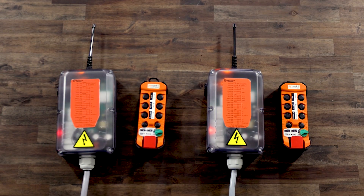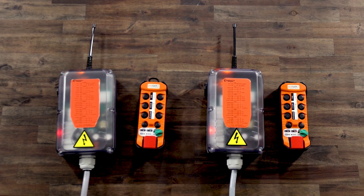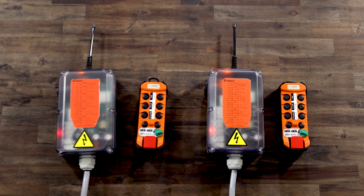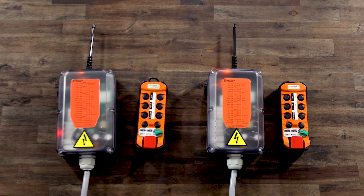We will start with transmitter A. First, ensure the E-stop switch is pulled out. Then, turn the on-off switch to the on position and verify the A through D LEDs flash. Then, press and hold F4 and F1 and turn the on-off switch to the start position and release. To disable automatic transmit power, press the AUX2 button. The B LED will flash 1 to 4 times, indicating the fixed transmit power. Press AUX1 until the B LED flashes 3 times. Then, turn the on-off switch to the start position and release. The receiver lamp will turn on and then off and the battery and radio LED will flash. You may now turn off the transmitter.